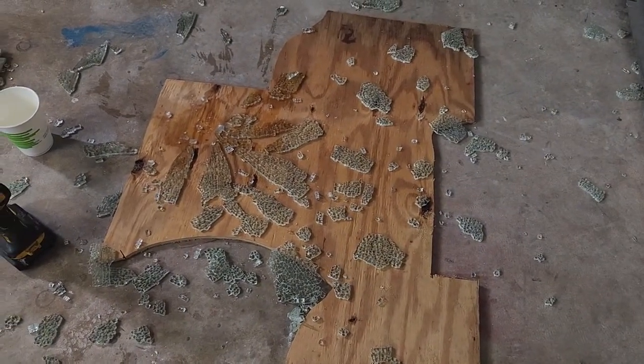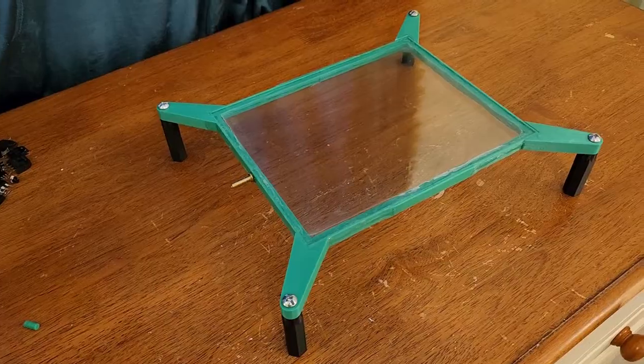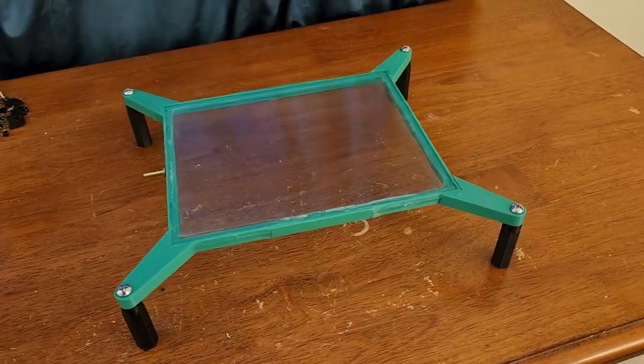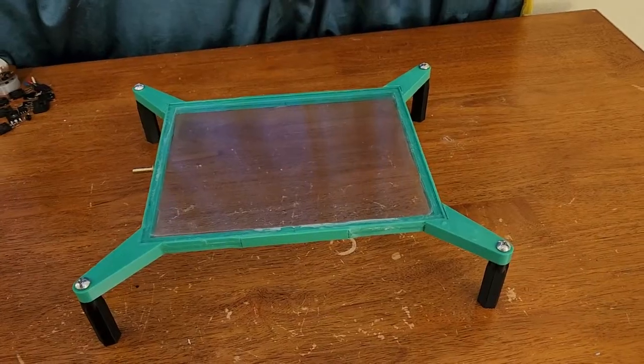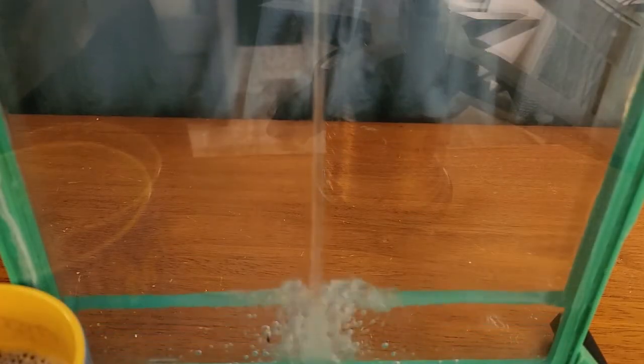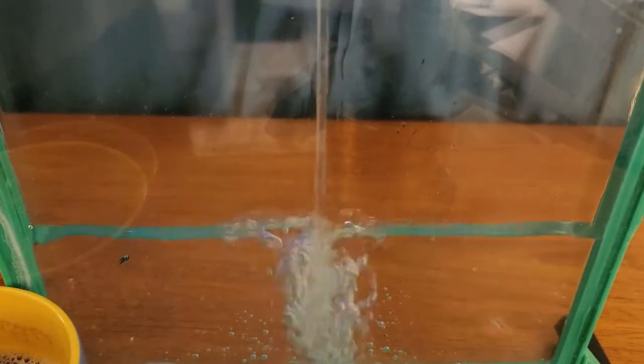For attempt number two, I simply used 8x10-inch glass sheets meant for picture frames and used a brass barb fill port that would double as a high voltage electrode. I also had to seal with CA glue because the silicone caulking would always get pinhole leaks no matter how hard I tried to seal it up.